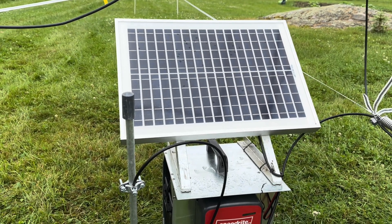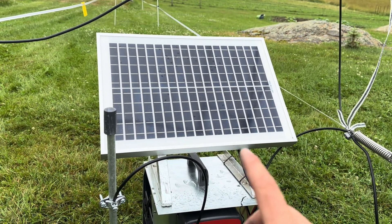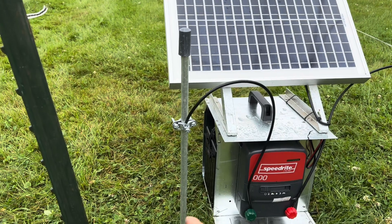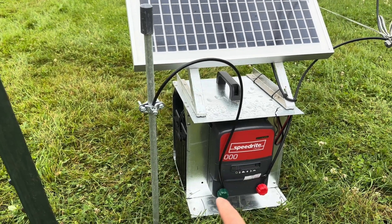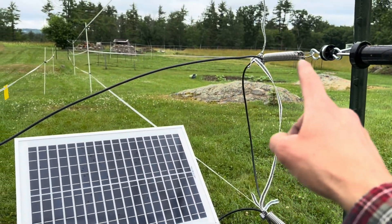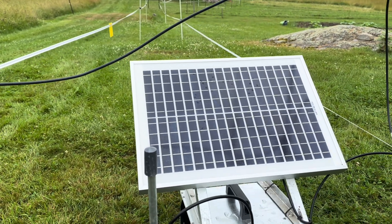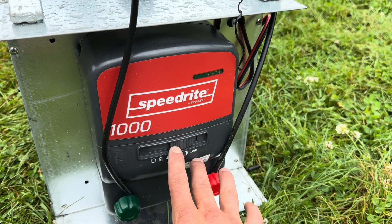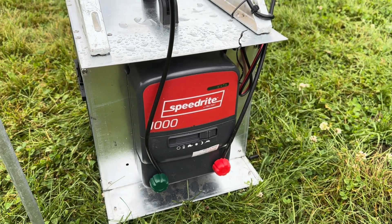Here is our charger — this is a solar setup. Wellscroft put this unit together with the panel. It's a large panel because we get some short days toward November and you need enough to charge the battery. This ground rod is six feet long; there's about two feet sticking up above ground, so it goes four feet down into the ground. We're wired up to ground and to the fence. The other wire goes under the gate, and then we're wired from this side to the outer fence line. The suggestion for deer exclusion was to use the fast setting.